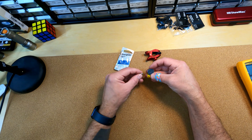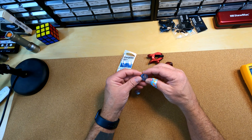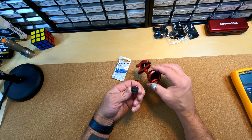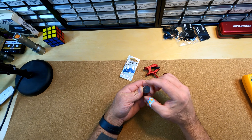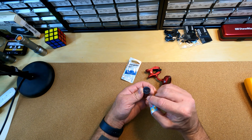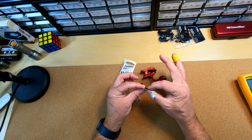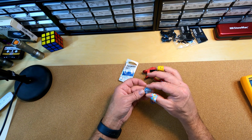The difference is in the name. This is what came out of the Shark — if you look at it, it's a CR2032. Essentially, C stands for lithium, R stands for round, the first two numbers — 20 — are the diameter of the battery in millimeters, and the last two numbers indicate the thickness. So 32 is actually 3.2 millimeters in thickness.